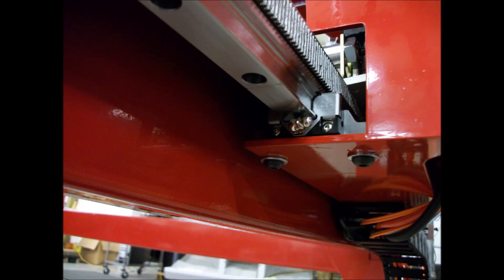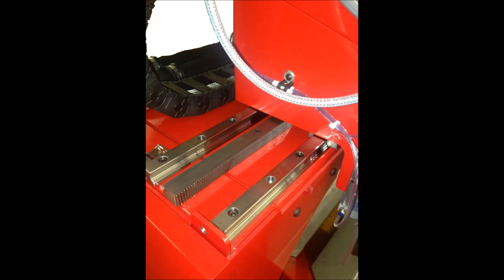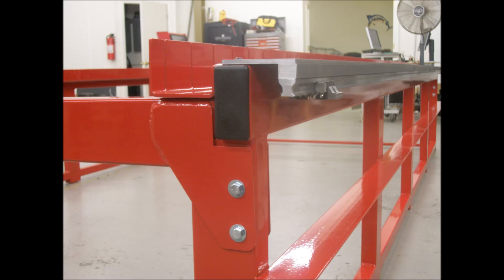The master side of the gantry rides on 25-millimeter linear bearings with two bearing blocks — the same size and type of rail used for large high-end systems, machining centers, lasers, and lathes. Hardened and ground to tight tolerances with recirculating ball blocks, this assures super smooth operation and locks the gantry to the frame. Cheap systems use cam follower bearings that ride on flat stock or even sheet metal, pressing dirt, spatter, and cutting dust into the running surface causing rough operation or requiring manual scraping. That is just not value — it's low cost, low performance. Cutting good parts requires smooth guides.